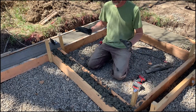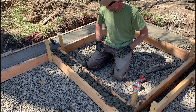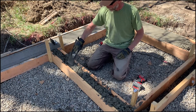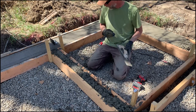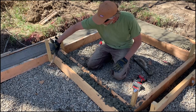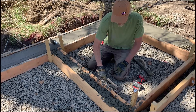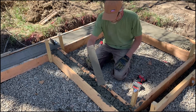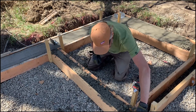I'm almost halfway through with the pour and it's going to take pretty much all of the daylight there is. I'm filling these forms with my mix dialed in — it's about as stiff as it can be yet still be workable. Once I've got the form filled, I tap it, get everything nice and flush to the form and settled in so I don't have any voids. Then I get enough material that I can screed off the top of the forms.